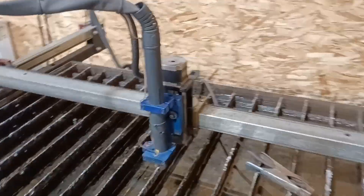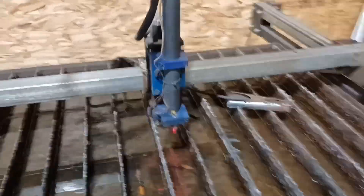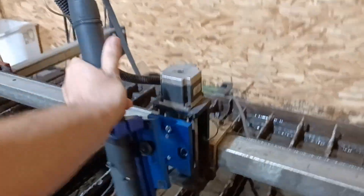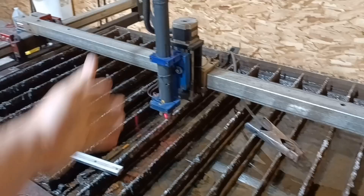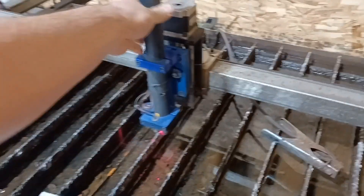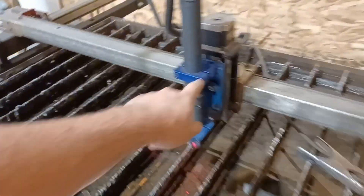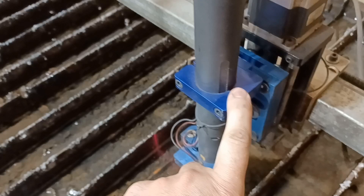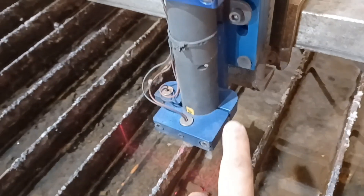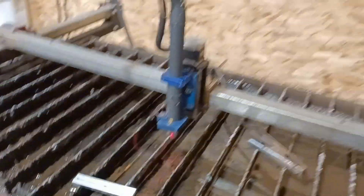This is a product that I make and sell on the website, BeckTools.com. It has laser alignment and also magnetic breakaway, so it helps you be able to change your consumable super fast and conveniently. Also, if you crash super hard, it should pop off. It makes setup and indexing super easy and it doesn't have a V-block, so it's not going to crush and deform your torch. You can see it has contact all the way around, making your torch last a lot longer.